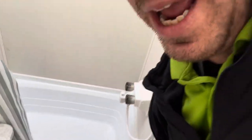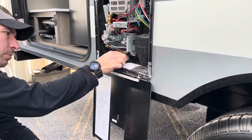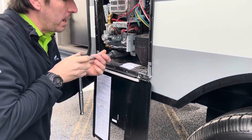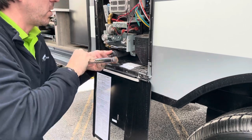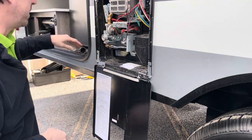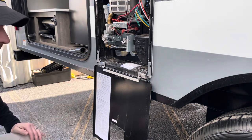Now we're going to talk about the hot water heater. We've got our hot water heater here — we're going to put the plug on it and start it by hand. This is a one-and-one-sixteenth socket. This is our low point drain plug. Some of you are going to have a different hot water heater that has an anode rod — you're still going to want to insert that because we're filling the hot water heater at this point. You don't want to over-tighten it, but make sure it's snug. I'm going to leave the tools out here so when I go inside and turn the valves on to start filling, I can come back and check for leaks.